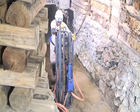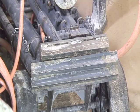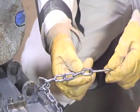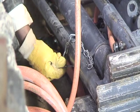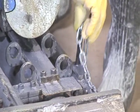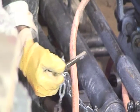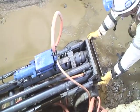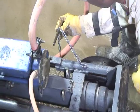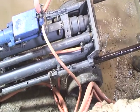Retract the stinger and tilt the drill rig off its wheels to access the extension footpiece. Remove the R pins from the rig's location pins. Extend the rig's footpiece by pulling the extension to the required additional length. Realign the pinhole. Insert the location pins and secure these with the attached R pins.